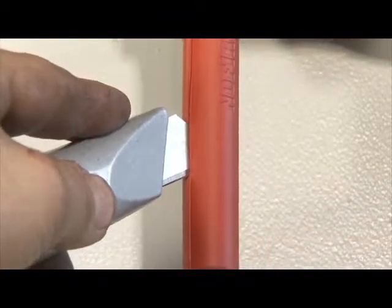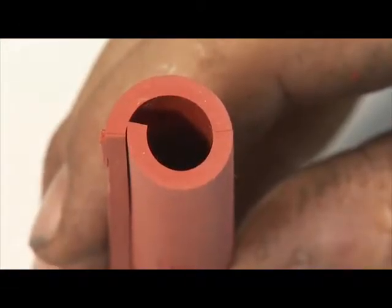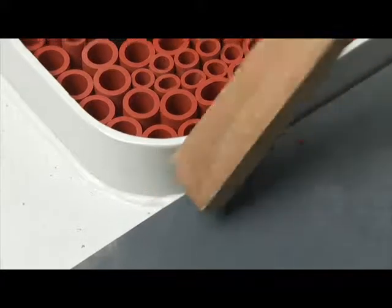To fill even the smallest openings, the filler sleeve can be split lengthwise, folded, and inserted into the opening using pliers. After filling the conduit with the crusher and filler sleeves, the complete set should be pushed 20mm into the conduit.